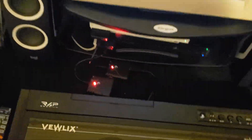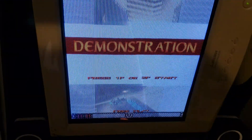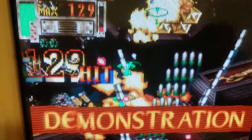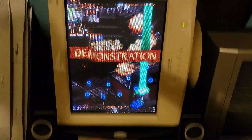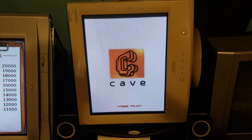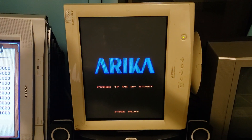Now I've got a 240p game running through the OSSC via RGB SCART. I put it in line double mode to get an amazing 480p image with scan lines. This trick takes a 240p signal, line doubles it to 480p, and then cuts the resolution in half with the OSSC's built-in scan lines — there are different settings for the scan lines but I left it on this one. In my opinion this looks just as good as a PVM, and I've owned PVMs. This really takes the cake.